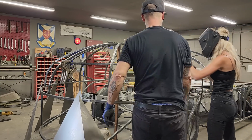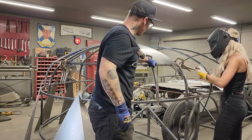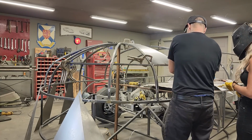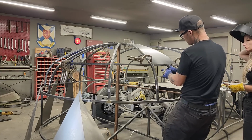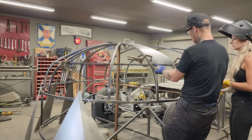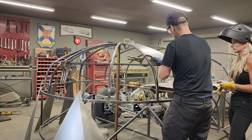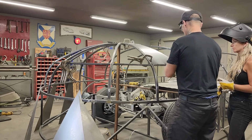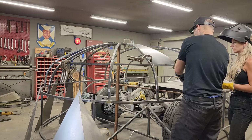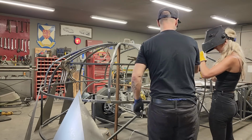Okay. We got pressure on it. We put a shape in it there. This bar is straightening it back out again. So what I did is I started in the center. See how we got a little lump going up in there. Started in the center. If I started over here, we probably would have had a big bump over in there. What I'm hoping I can do is run that out both ways. But with the shape that I put in it, I'm hoping that it's keeping tension on that. That's what we want. We want something really rugged. Just stick that on real good there.